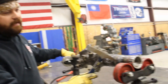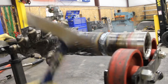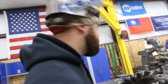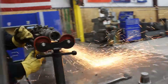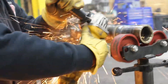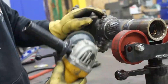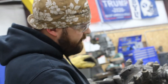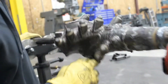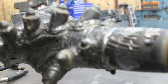So there's our second pass. Let's get to grinding. So we got our second joint done, we got it all beveled. If you come in here you can see we beveled it clear down to the original joint. Probably take us two passes to fill it up. Let's do it.